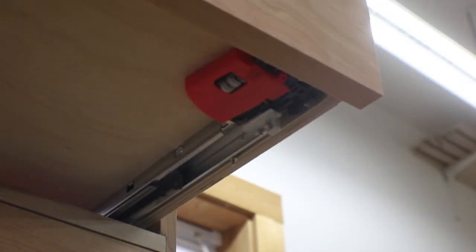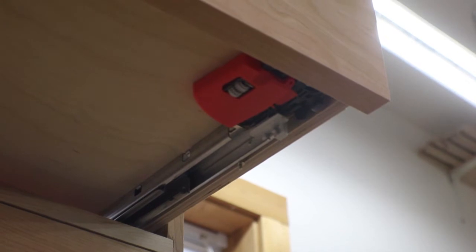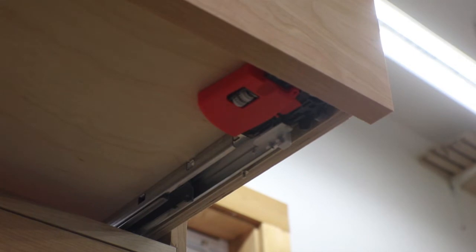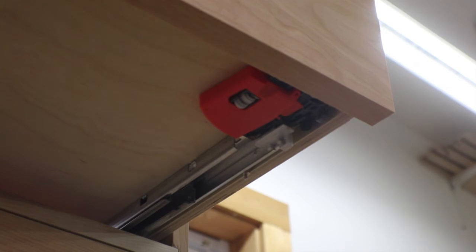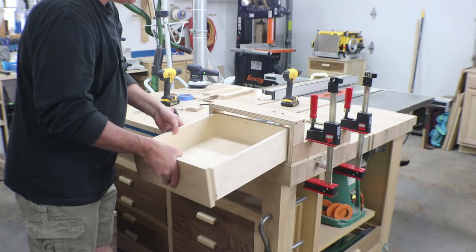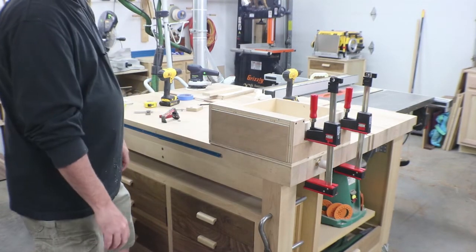Now you notice the adjustment on this drawer has those little turn knobs on them. They allow for adjustment side to side of the rail and your drawer front. So on my mock-up, I didn't have this feature, but in the ones I did for the closet built-in, I had this feature on them, and they were sure handy for getting the drawer fit just super nice. And then assuming you followed all the directions and made your box square, it locks in and functions like it should.